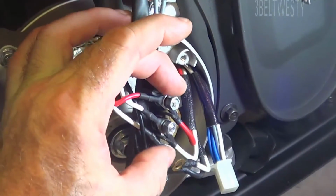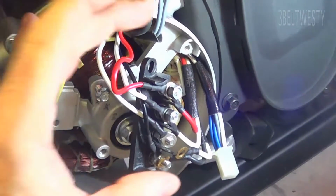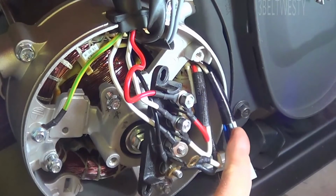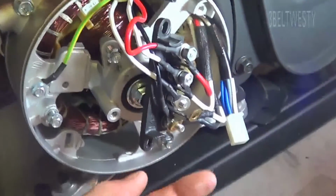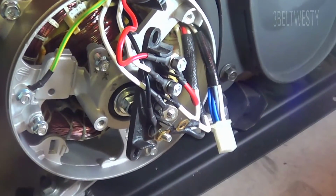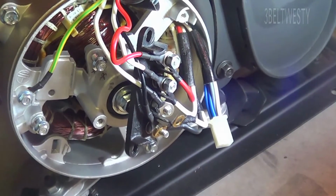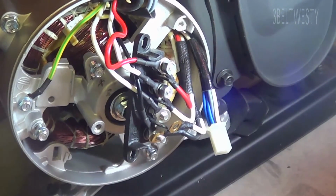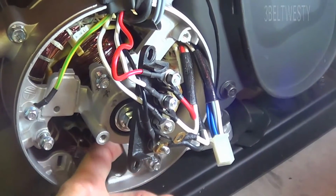One solution is that when they're in parallel, you could hook a transformer up on the output, and don't use these two wires, and then go ahead and feed the AVR directly with a sense voltage off a control transformer. You might be able to use a voltage divider too. I'm not sure what the input impedance is, i.e. how much current the sense circuit uses. That's another test I'm going to have to run.